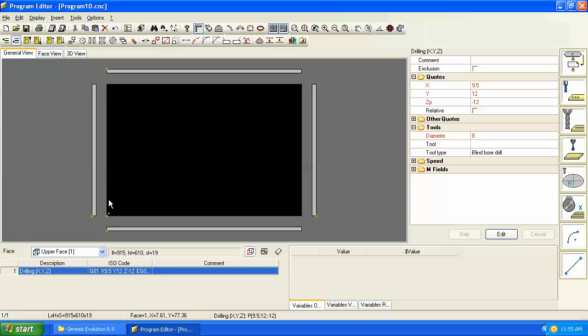If we have a rail here, we want another hole 64 millimeters away — 64 being a multiple of 32. We want the machine to drill both holes simultaneously, and provided we have drills on 64 millimeter centers, simply programming these 64 millimeters apart is sufficient for the machine to automatically drill both simultaneously.